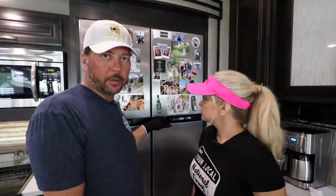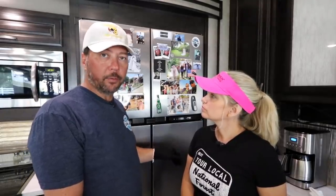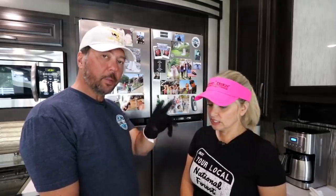Ours has been pretty good and our seal is pretty good, but if you have one where the dollar bill test just zips right through or sticks and you require some extra maintenance, you might want to empty the fridge into a cooler so you have plenty of time to let the hairdryer sit there and expand it out. Just don't leave it on there too long. Use your head. Don't leave it on there till it melts. That would not be smart.